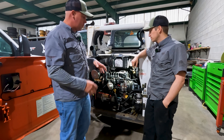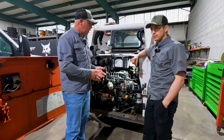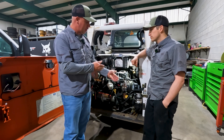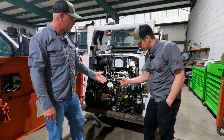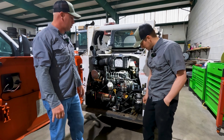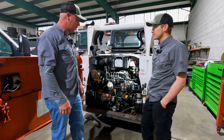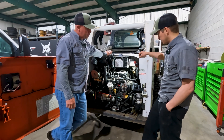When we're out working this machine it wants to try to die off and it'll actually stall the engine. We're thinking that based off that information we've got a fuel delivery problem. But it's probably not coming from the tank because the primer bulb isn't squeezing flat, which points to fuel delivery downstream of the tank.